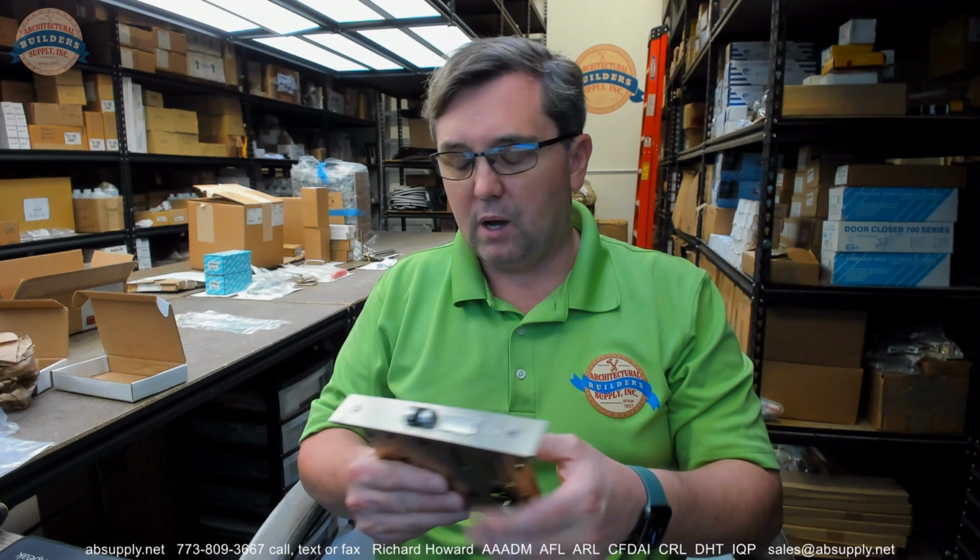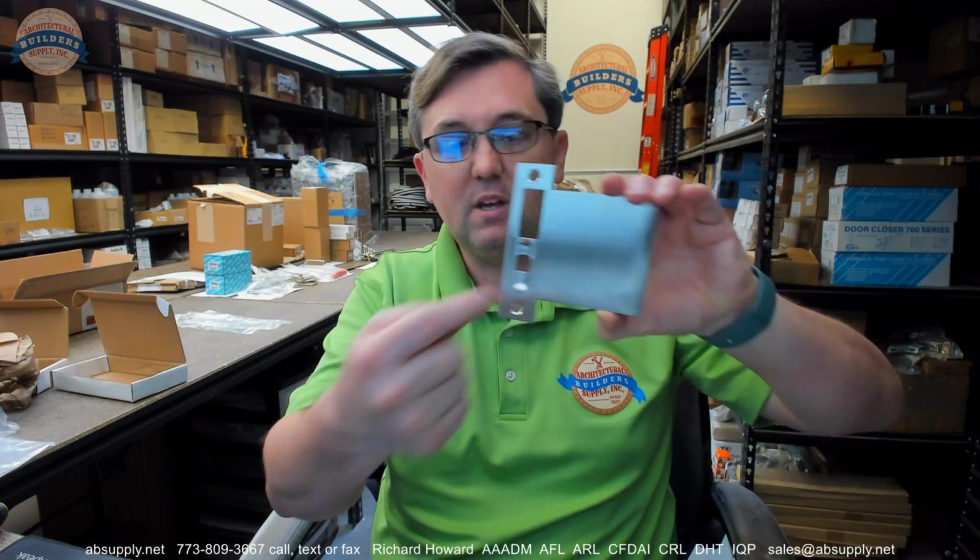Would I end up using one? Sure, I wouldn't see why I wouldn't. There are less expensive ways to ultimately accomplish the job. However, I think what really forced this client into this sort of application is because of this. 7-inch door thickness, okay? And they were centering the lock in the door. A standard roller latch, of which you can put 2 or 3 on there, you've got a problem with that strike. That's a cast strike on those items.